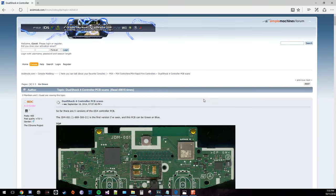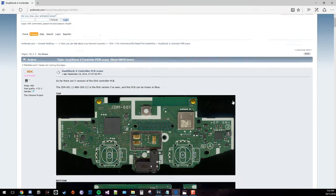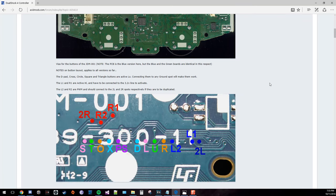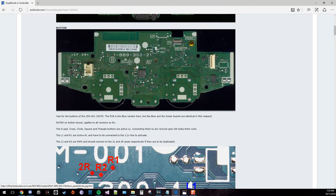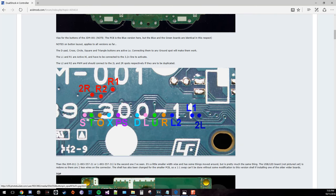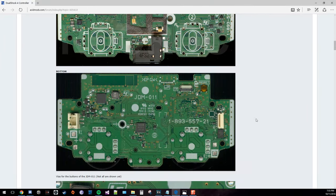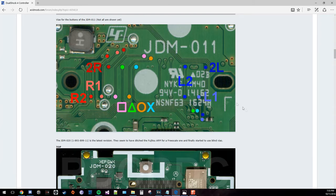So for the actual contact point that you're going to be scraping and soldering to, there's a website called acidmods.com, and they have a forum here with a bunch of PCB scans. I'll have a link in the description for this website down below. But as you can see, with the scans, they show the contact points that are related to their buttons. And as you can see, this one has the right trigger. This is a community forum, so it's community based, and people figure out which ones are which by submitting.